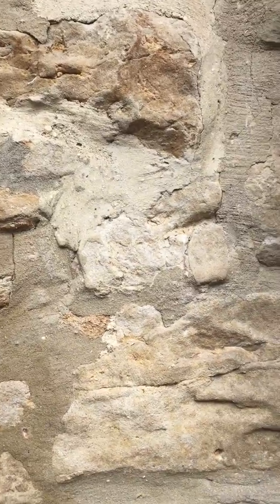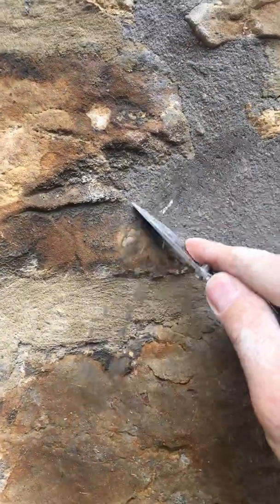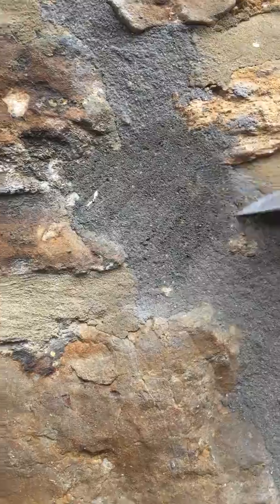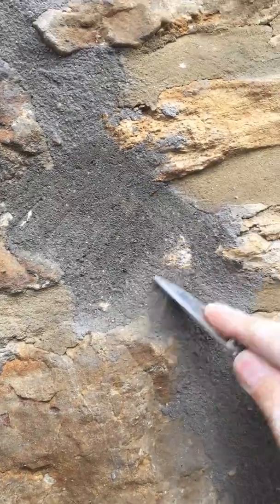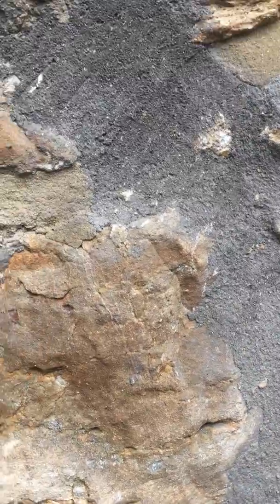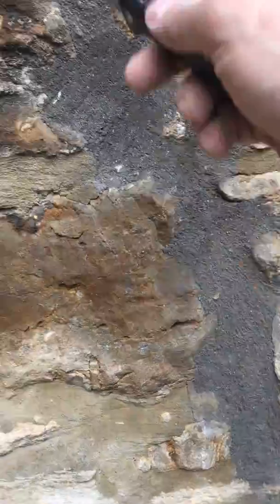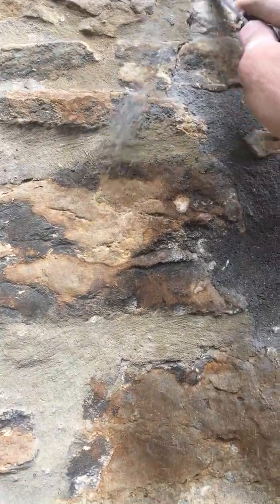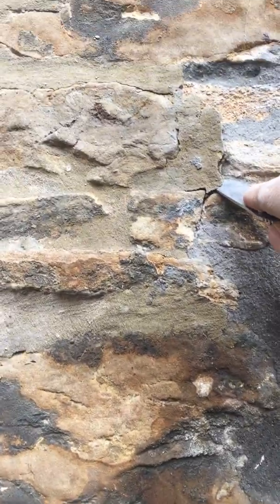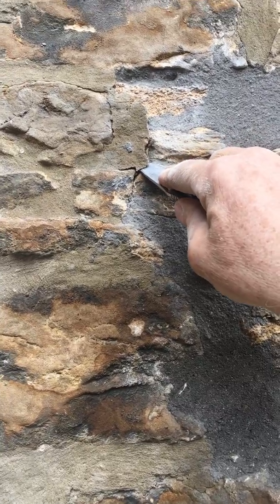What you actually get is rotten stone. I'm doing a repair at the minute on the brickwork and I'm just trying to dye the water down a little bit so it at least ties in with this awful cement pointing. As I took it out because it was all cracked and really messed up, I noticed that the stone — look at this — the stone was rotten.